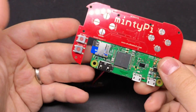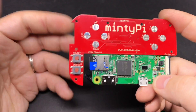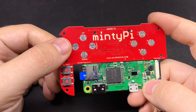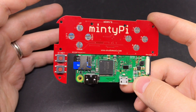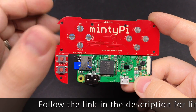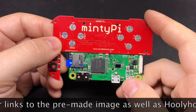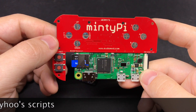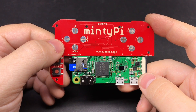I keep mentioning these scripts by HooliHoo — after you install this board, you will need some software updates to make it work. I've gone ahead and updated the pre-made RetroPie image, so if you want you can just burn that to another SD card and it should be all set up for you. If you've already got your SD card set up with a theme and games added, you can pull it down from HooliHoo's Git repo and install it yourself — that's probably your best bet so you don't mess anything up.